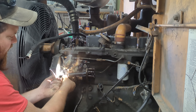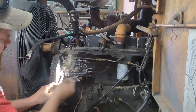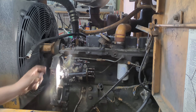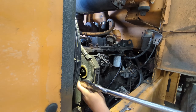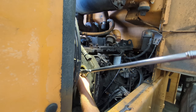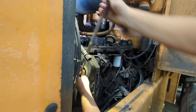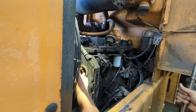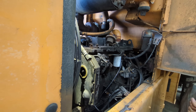It's just as simple as taking this tab out right here — you loosen it, take this tab out, and then you tighten this back up. When you tighten that up, it actually puts that bolt into the pump shaft and holds the pump on top dead center. Now we can go ahead and remove our nut off the end of our injector pump shaft. You're supposed to put a towel down in the bottom so you can't drop the nut down in the timing gear case, but I'm not too worried about it.